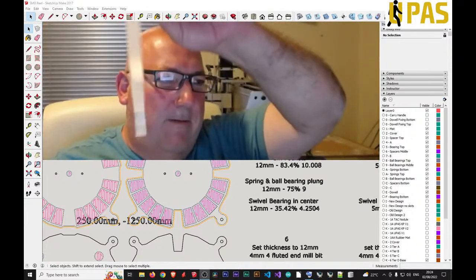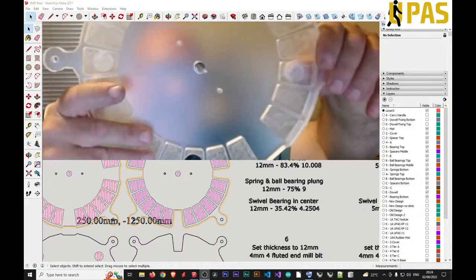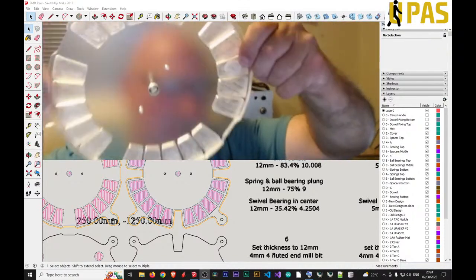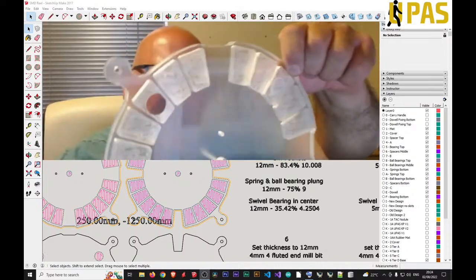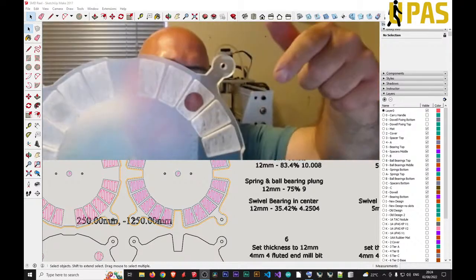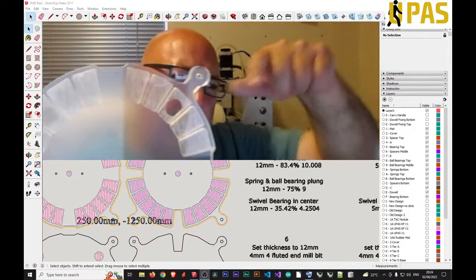It spins. There are a few mistakes — I'll quickly go over them. I tried to mill two finer cuts for some rubber feet and you can see I've gone straight through. You've got a 10mm pocket in 12mm material, and a 1mm recess for a rubber foot.